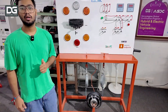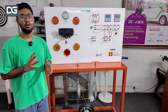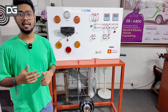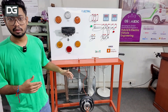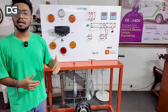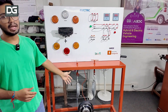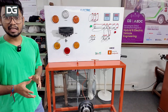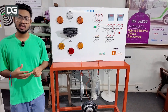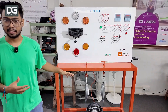There is one more very important thing — this is your motor efficiency testing kit, where you will understand how the motor is working and what efficiency you are getting from the motor itself. We can take multiple readings by putting on different sorts of loads, implying mechanical loads, and then calculate what the actual efficiency is coming out of this particular motor setup.